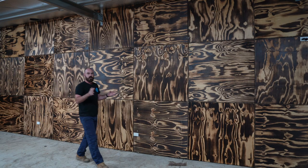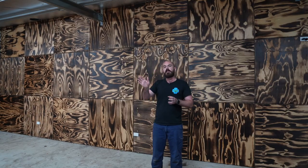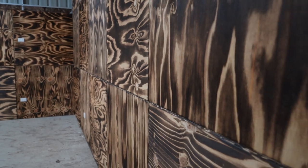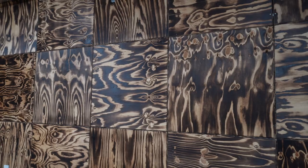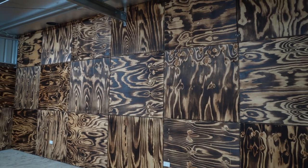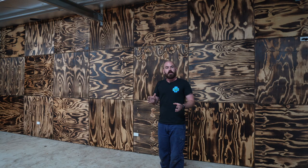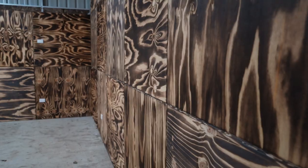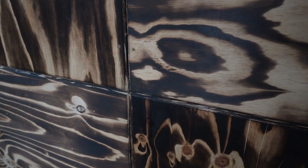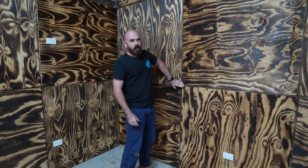And this is the result. It's laid out in a checkerboard pattern with the grain going one way and then another, repeated except one across on the next row. The look is extremely busy, but I really like the wooden textured approach. There is not a single repetition of pattern and it makes for a really interesting and budget-friendly cladding. Plywood is available almost everywhere in the world and if you're thrifty, you can pick it up dirt cheap. The chamfer on the edges hides a lot of the inconsistencies in the wall due to the non-600 spacing and also gives a visually pleasing corner where the sheets meet.